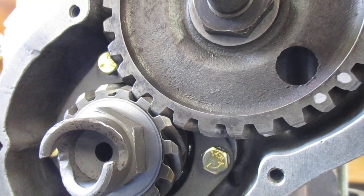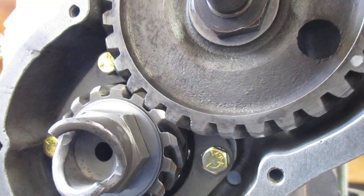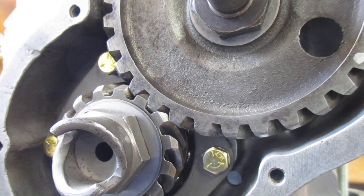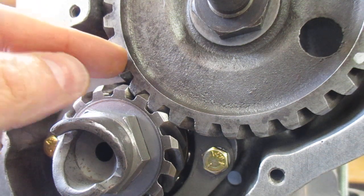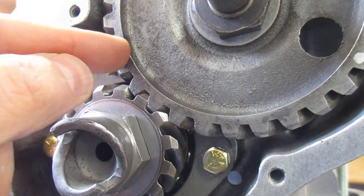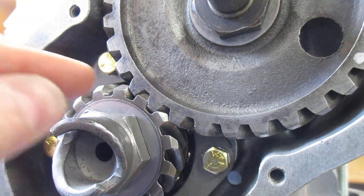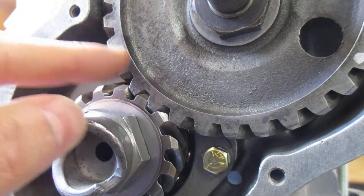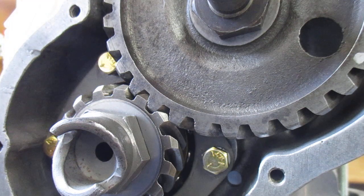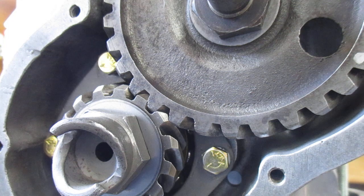So the question is, are these gears suitable to use or not? In a few places I've noticed the very edges of the teeth in a couple of places do get a little bit chipped or worn. I think it's just chipping from damage — parts sitting in boxes and things. Usually in that case what I've done is just taken a tungsten burr in the Dremel and just smoothed them off so there's no rough bits or little pieces that can break off. I'll put this up online and see what people think.